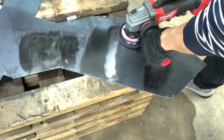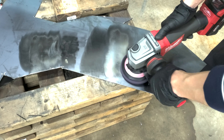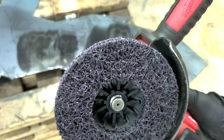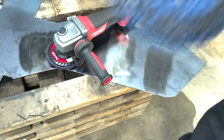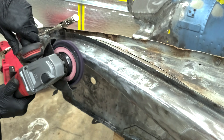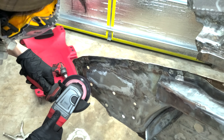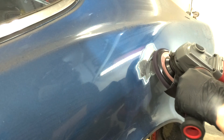This basically speaks for itself — it's working effortlessly through the mill scale, even better than the easy strip disc, and for whatever reason it clogs up a lot less. I'll show you a disc I've been using for weeks doing nothing but clean up mill scale — there's still a little residue on it, but it's not enough to render it ineffective like it did to the easy strip disc. The Scotch-Brite disc also does a lot of things really well, including making quick work of surface rust on sheet metal without heating it up, or even removing paint and primer. I'll link to the product below in the description.